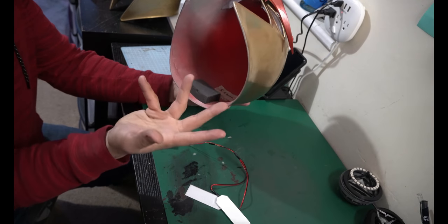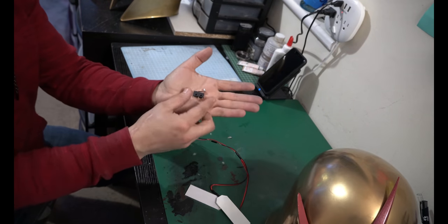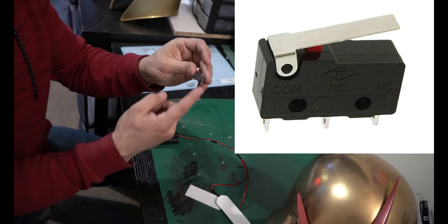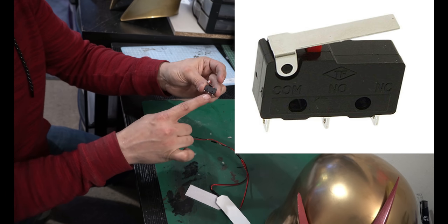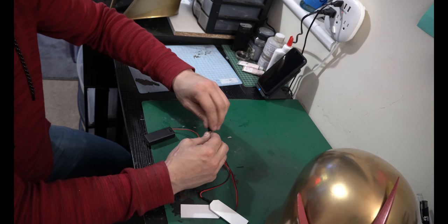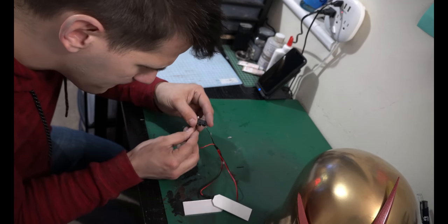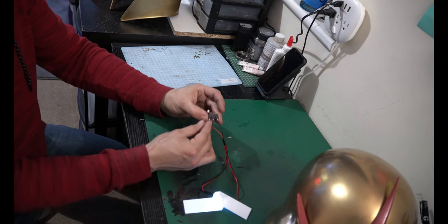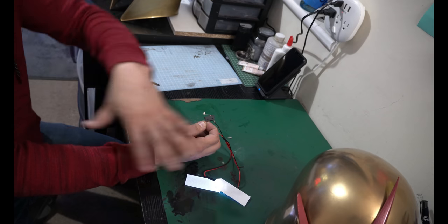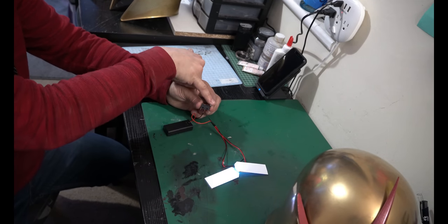The system I did in this helmet is pretty much 99% the same way. However, now I have a limiter switch sitting on the top — so when it touches my head, the eyes turn on. I use these little limiter switches in my Iron Man helmets, suit, and other props. Electricity comes into the common pin. It comes out either through normally closed or, once you hit the trigger, flips to normally open. We want normally open — so when I'm not pressing the trigger, the circuit is open and the eyes are off. When my head presses the trigger, the eyes light up. That's it.